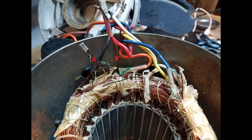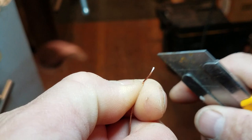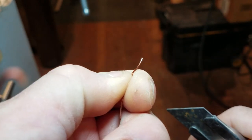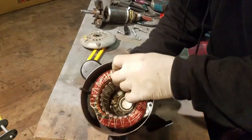We'll cut the wires here and swap them around. The best way to reconnect these wires is to solder them. Before you do that, you have to scrape off the insulation. Then we're going to put the motor back together temporarily and test it out.